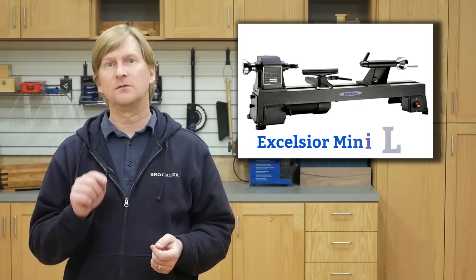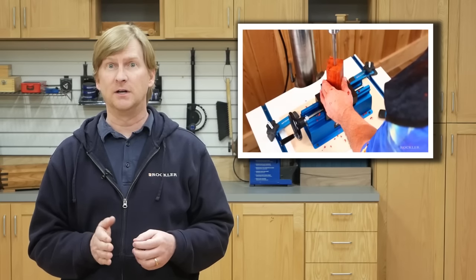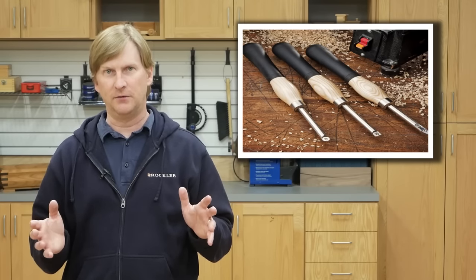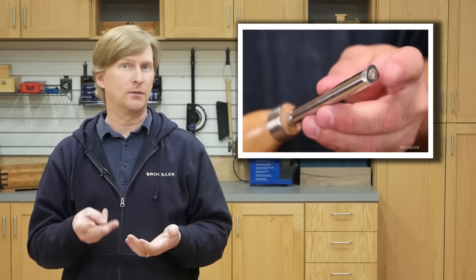That covers the materials — so what tools do you need? You're obviously going to need a lathe, but the good news is a small mini lathe is perfect for these projects. You're also going to need a drill. A drill press is best because you're going to need to drill straight, accurate holes, but on some of the handles you could get away with using a handheld drill. You're also going to need turning tools. There's a huge range out there, but if you're just getting started, I'd recommend the carbide cutter head tools — we've got some starter sets where you get three tools. These are easy to use and the best part is they don't need sharpening. When one part of the blade gets dull, you simply rotate it and keep going. Then finally, you're going to need some sandpaper and some finish. There are obviously lots of other specialty jigs and accessories you can get as you get into woodturning, but these are really the core tools you'd need to get started.